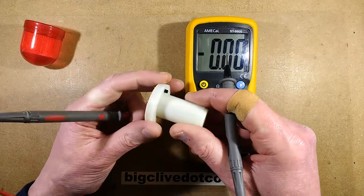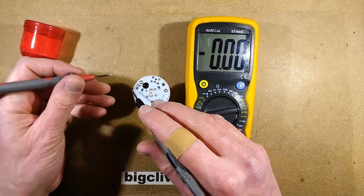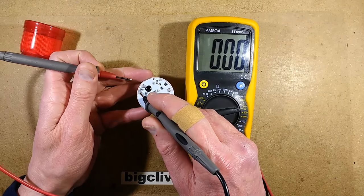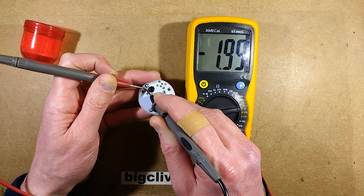But what if I put the battery the wrong way around? To me, that would show a higher voltage. If this is actually limiting the current, the chip would probably be trying to short the rails out at this point in time. I should get a modest voltage across that. Yes — I'm getting 2 volts. That must be what it's for.